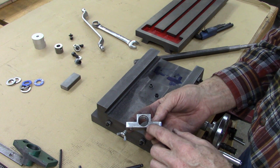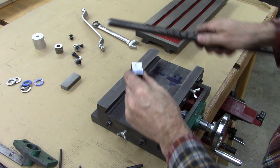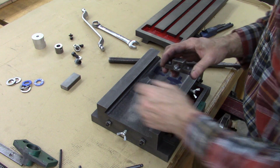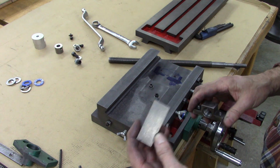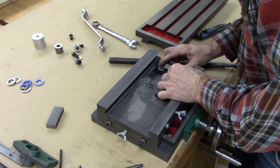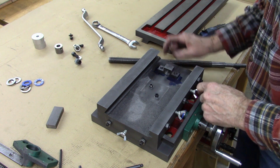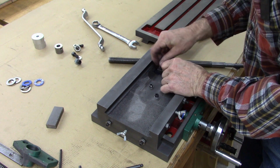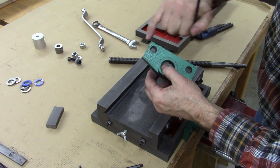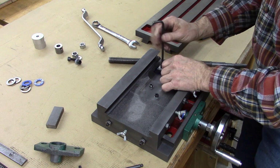I made this in my drill press, and I had that very slightly cocked this way, and I had to mill the bottom of it at an angle to make that work. So drill that in your 4-jaw chuck, or a mill. So I've got some scribe lines here because I know where it worked and where it worked well. So I really struggled with getting this alignment until I realized I needed to oversize these holes, and after I did that, it allowed this bearing block to float, and it worked way better.